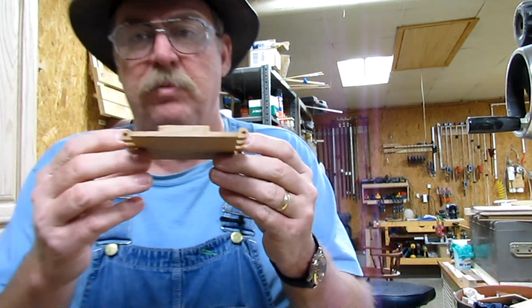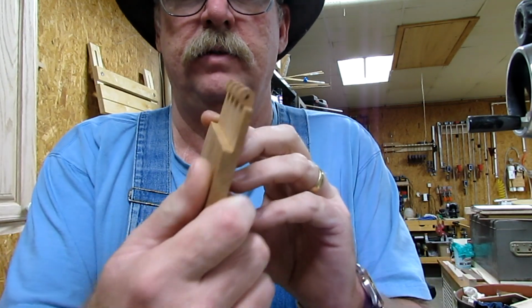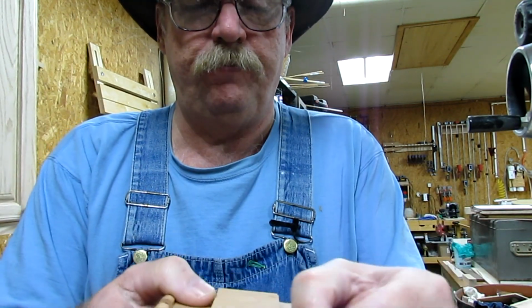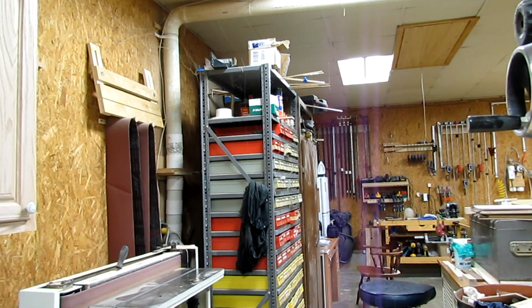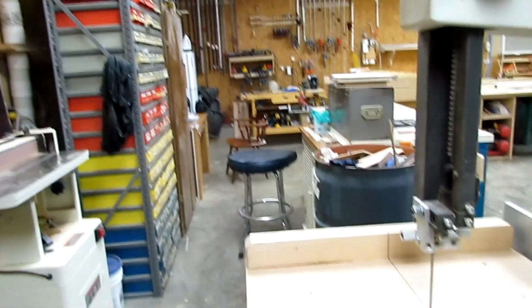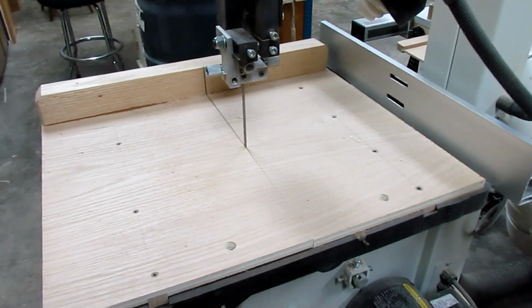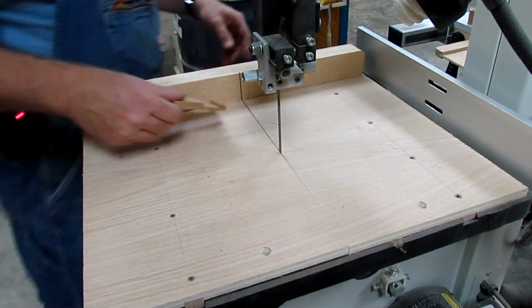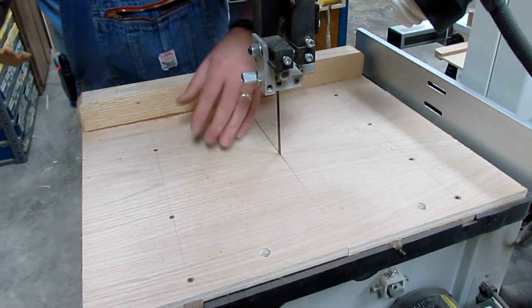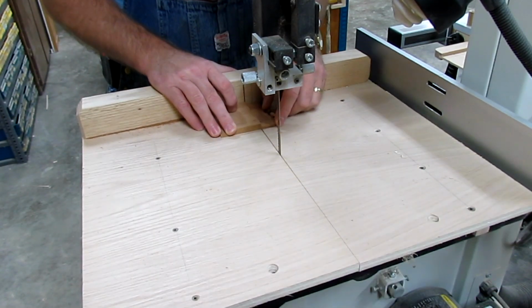We're going to take this hinge blank that we've cut the barrels on, made the fingers, and bored the pin holes. Now we're going to cut it here at the leaf. This is all waste. This will be cut off where we can actually put the hinge together. We're going to cut that off with a bandsaw. I prefer to use the bandsaw. It doesn't have as much chance of breaking the hinge, and this one I've got set up where it cuts plenty smooth for the leaf. Just have plenty of control of it with the sled, and it really works great.